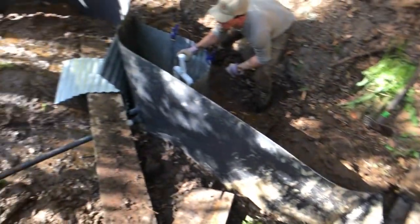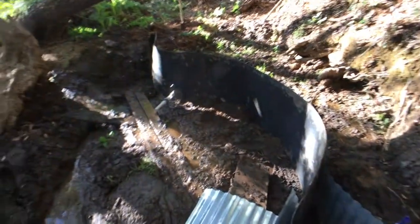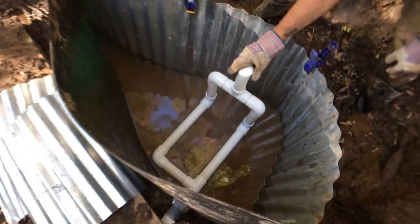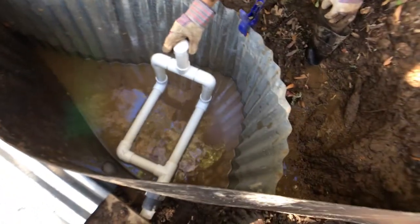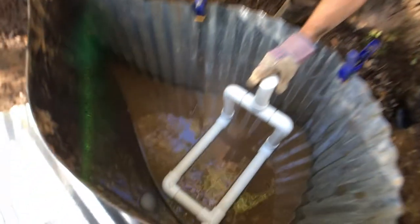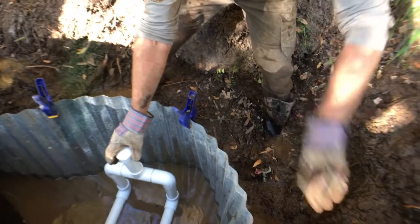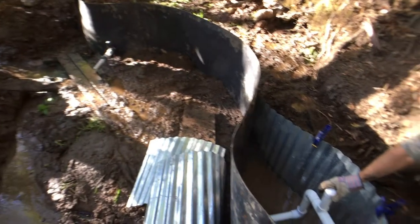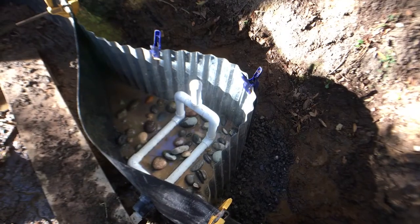We have our wall in and sealed to the bottom with clay. We've measured the preliminary first flows and we're getting around two and a half gallons a minute total. We just put the collection piping in and we're building the first containment area for the cobble that we're going to cover the collection piping with. Once we've done that, we'll put the drain rock out here and pull out the sheet metal, so we've got one continuous layer of rock filter package that'll keep the native material back into the hill. No sign of leaks anywhere — it was a bit of a mad dash to get this all in, but we're flowing.